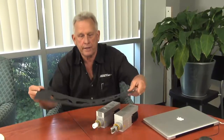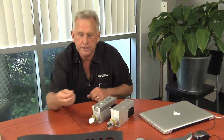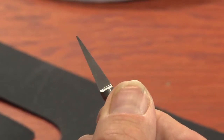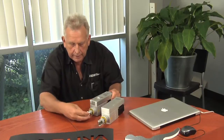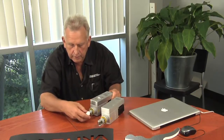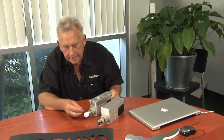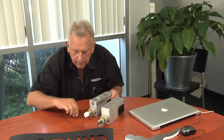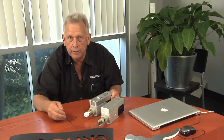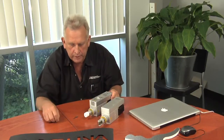So we need another technology, and that technology is called Tangential Knife, and it's done with a tool just like this. Okay, so a knife like this mounts into a head, and then it has a pressure shoe that goes on it, and that's spring-loaded. Now what happens is, as this goes around the geometry, which would be required to cut, this head rotates it automatically, and it always keeps it at the correct angle for the cut, and that's called tangential cutting, and we'll look at that in a little more detail.